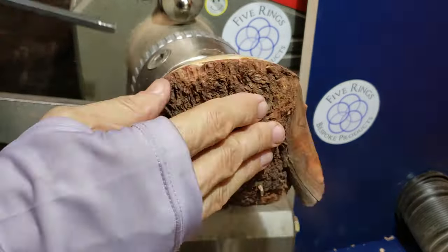I used this half-inch cleaner gouge from Carter & Son for this task of removing the tenon and the nub, because the grind on it is a little bit of a sharper angle, almost like a spindle gouge, and it allows me to get really tight in there with the little nub and shear it off nice and clean without having a lot of tear out.